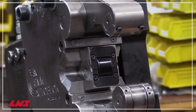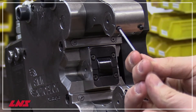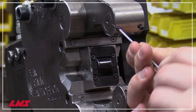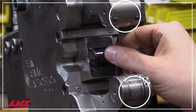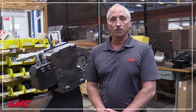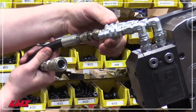Next, we will install the outer bearing chip guards. The top or upper arm of the steady rest gets the full outer guard and the opposite outer arm gets the smaller shield on the inside of the arm. Once these are installed, it is necessary to check the roller bearing again for free rotation. The additional scraper guard piece is installed over the outer chip guard and snug tightened for adjustment later.